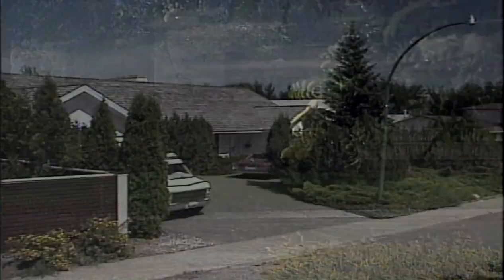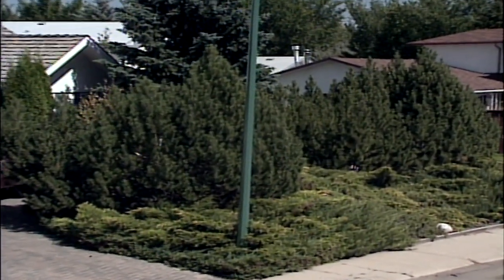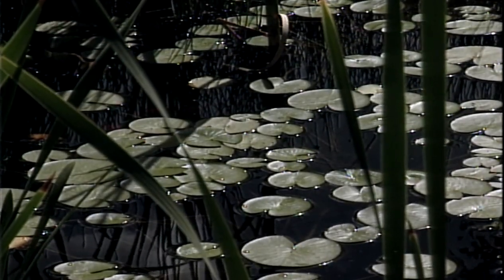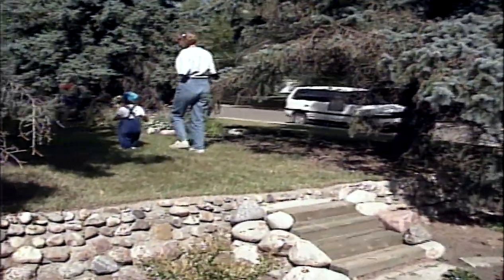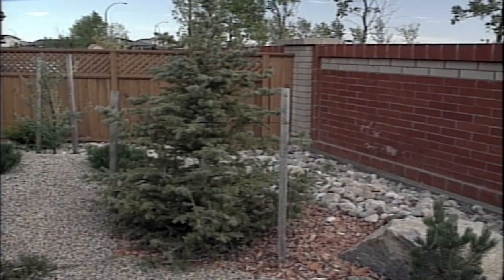Whenever possible, slope hard surfaces like driveways and walks toward grass or planting areas that appreciate water, so the runoff will go there rather than into the street. Natural moisture can also be conserved in ponds or cisterns in the same way. On steep slopes, create terraces to interrupt and catch the flow of rain or meltwater. Put a catch basin or a series of gravel catchment pits at the bottom of the slope to hold the runoff.